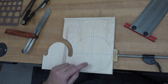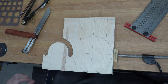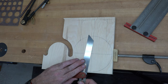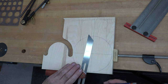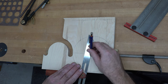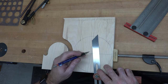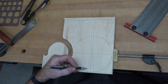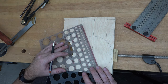Out from our center line I've come out half an inch on the outside of the circle and one eighth of an inch on the inside, and placed a mark. I'm now going to set my bevel so that it lines up with both the bottom and the top mark, and once I'm happy with that I'll lock it down. Then all I have to do is line it up with one of the marks and draw my line. I'll turn this over — it's all about repeatability. We'll do the same thing on this side, and there is our notch. We can round this off so that we don't have that really sharp notch that might take a little bite if you were to jam your finger on it.